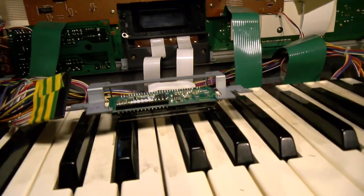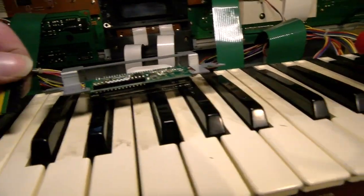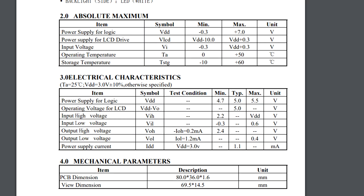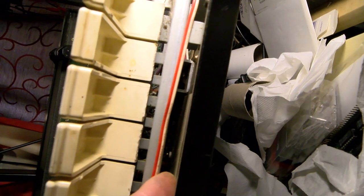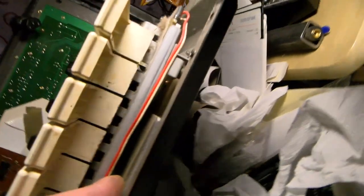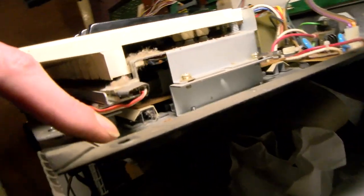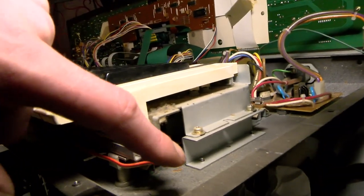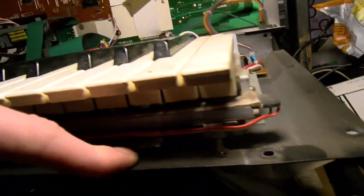Lastly, and probably most importantly, VFD displays use far more power than an LCD. Our LCDs use a few microamps, and the LED backlight probably uses about 20 milliamps. This doesn't add much load to the power supply, which is good for about 3 amps at a stretch, and it's on the digital supply rail, so that has to run all of the logic in the synthesizer and the EL driver when that was connected.